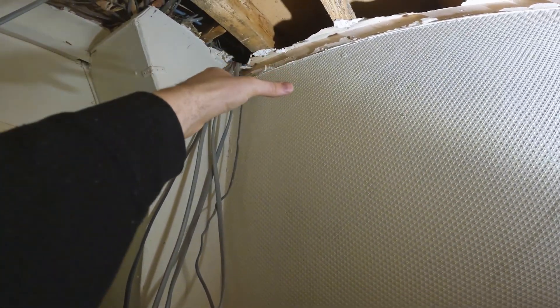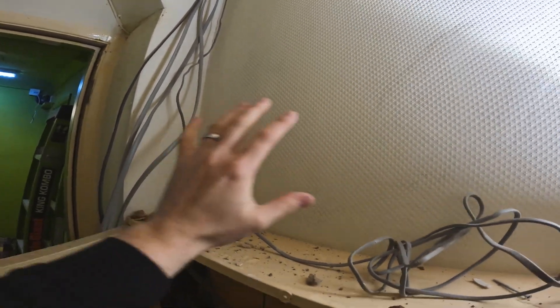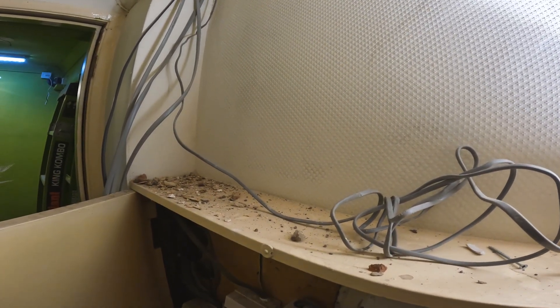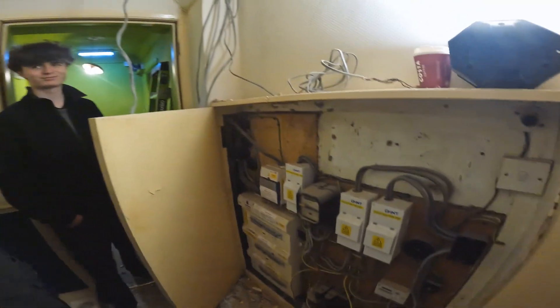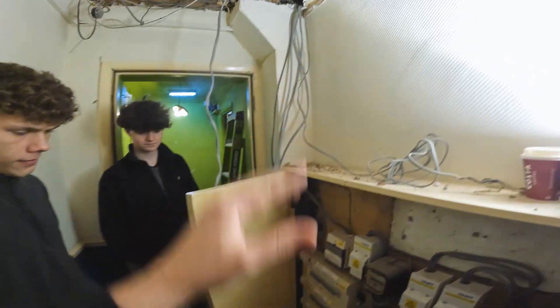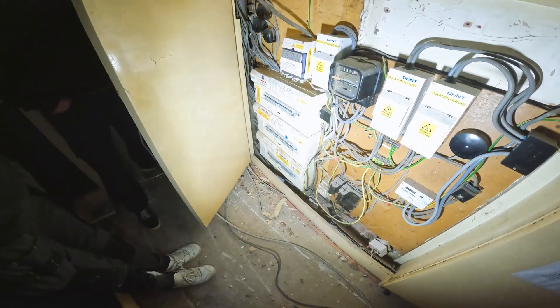We might go off like an L - come down, go across and then stop and get it in line with the edge of the fuse board. So you'll just see a fuse board here, cut through the bottom and come into the bottom of the fuse board. I think it'll look somewhat neat-ish. But we're basically polishing a turd here. Normally if this was a full rewire you'd rip all this out, get your main tails coming in and then build something beautiful. But that's not gonna happen here.